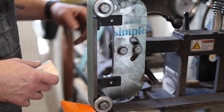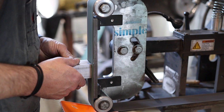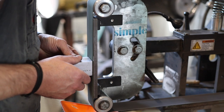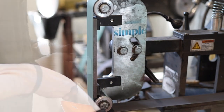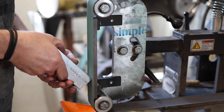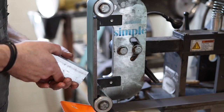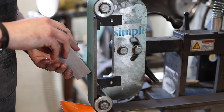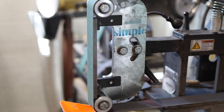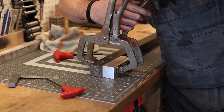We'll clean it up and remove any burrs — accuracy is what we want, so any little burrs hanging off the end would adversely affect the final result. When you're building projects, even something as small as this, it's amazing how if you have a couple of steps not quite right, by the time you add them together you can end up with something that just doesn't work. Taking the time at every single step to debur after each process really helps keep things consistent.